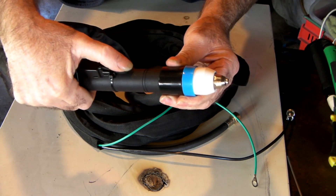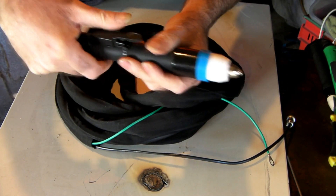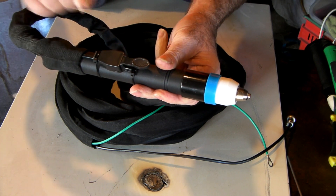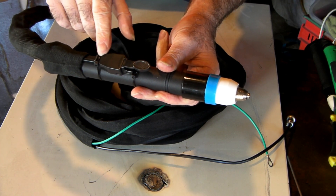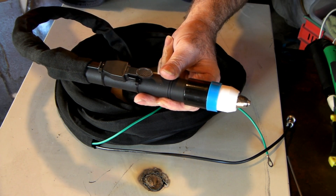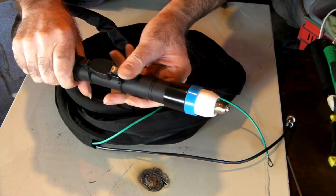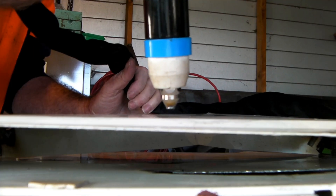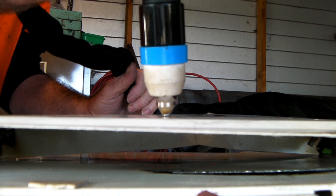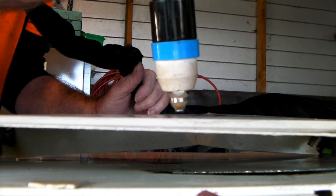There's my 80 to 100 amp — that's the big sucker, the P80 torch. As you can see, it's got the same lead and a little on-off switch. So what you do if you're going to use this for your CNC is you can leave the switch on there, and just on the other end where the plug is, plug that into your computer control system and that'll work good. I'll kick this in the guts and show you how it works manually.